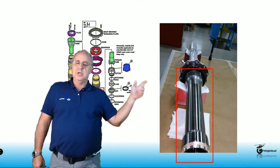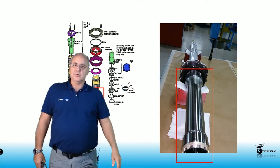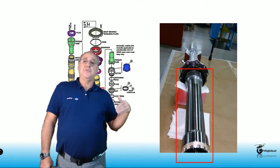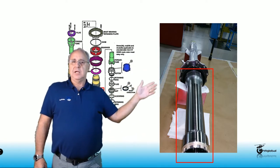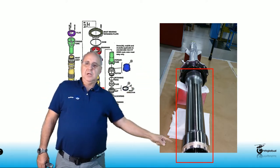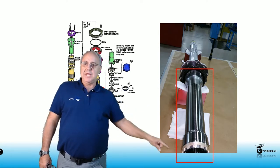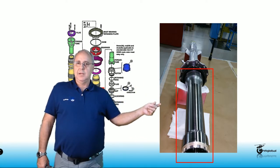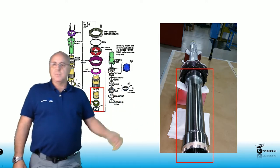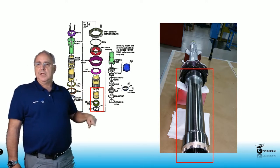You have to remember that if you have very invasive corrosion or damage requiring a repair or rework, the mast itself only allows one repair. If this mast already has one rework and you need to do another one, it's not allowed. The whole mast post is going to be discarded. When I say the whole mast, I'm not talking about the bearings and everything — just the post. The post only allows one repair.